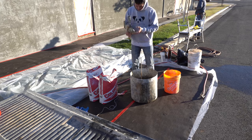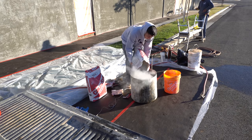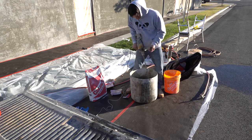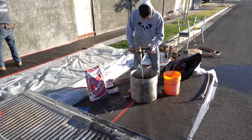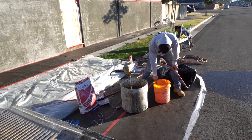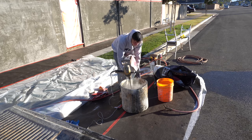Nick's going to be mixing up the stucco — we're mixing two bags of stucco in this one bucket. Put water in first, then your color packs, and then mix in your stucco little by little. You don't want to add both bags at the same time or you'll jam up your drill and paddle. Make sure it's not too loose — you want it nice and clumpy, and break up any balls inside the bags so you won't have bumps and lumps when you're spreading it.